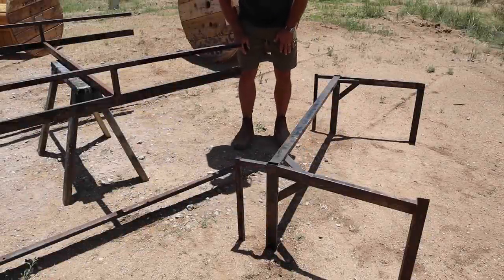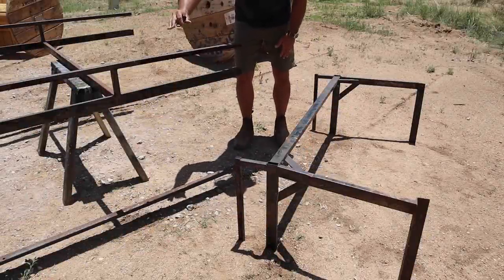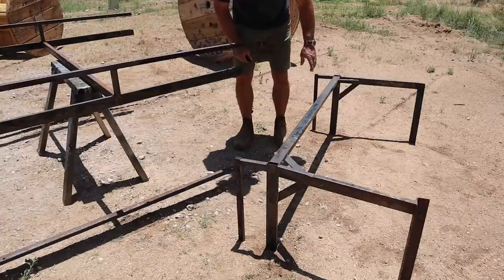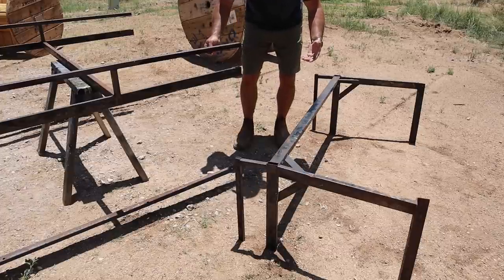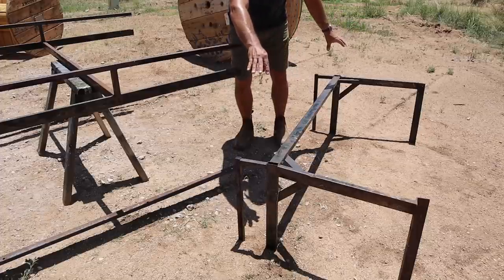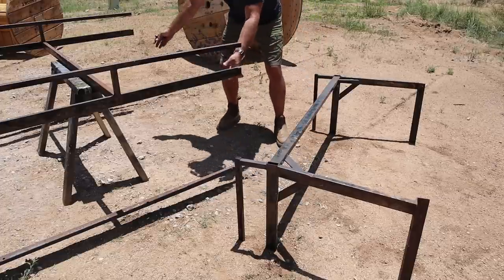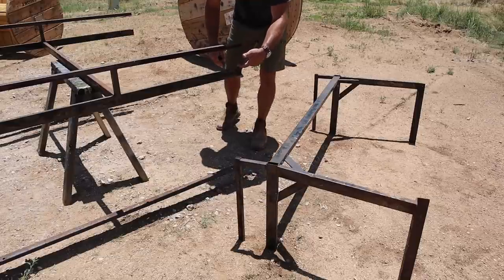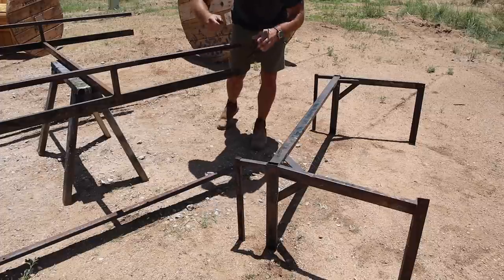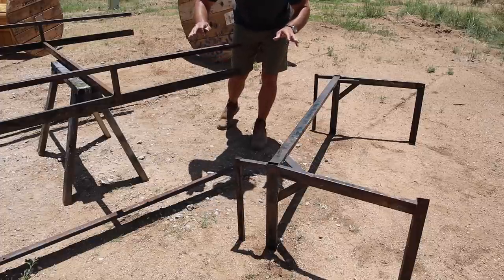The first big step is accomplished - I cut the back end off at the length I want the truck rack to be. The reason I did that is because the angles built into the frame were made for a much wider truck bed. Instead of cutting off the vertical supports and trying to bend everything in and potentially tweaking it, I figured I'd just take these individual components and rebuild them. I'll put this crossbar here, fill these in with the same one-by-one material, finish cutting off the front lower section, mount it in the truck, and then weld each of the vertical legs so it custom fits my truck and everything's nice and level.